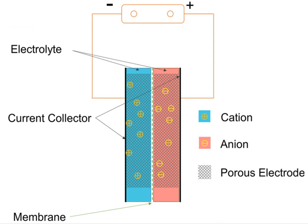Storage principles. Electrochemical capacitors use the double layer effect to store electric energy, however, this double layer has no conventional solid dielectric to separate the charges. There are two storage principles in the electric double layer of the electrodes that contribute to the total capacitance of an electrochemical capacitor. Double-layer capacitance: electrostatic storage of the electrical energy achieved by separation of charge in a Helmholtz double layer. Pseudocapacitance: electrochemical storage of the electrical energy achieved by Faradaic redox reactions with charge transfer. Both capacitances are only separable by measurement techniques.